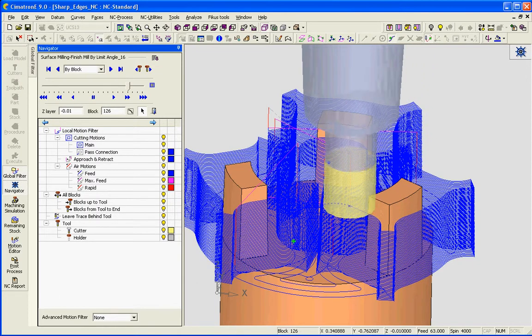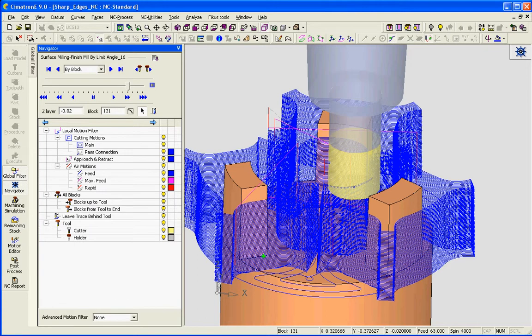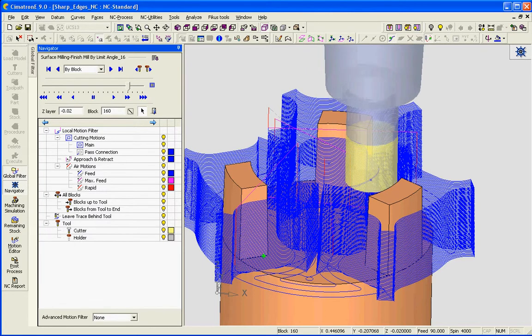Furthermore, the bottom is actually machining to zero, taking off that last thousandth and giving us a nice sharp edge at the bottom, because the previous cutter was a bull cutter.